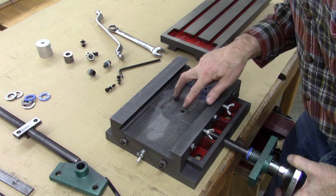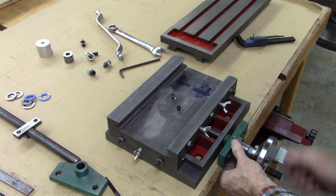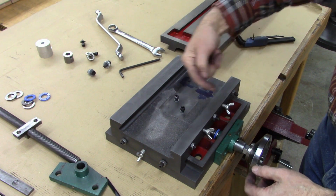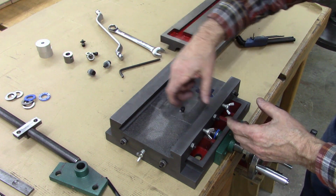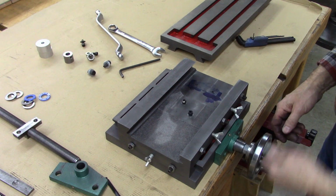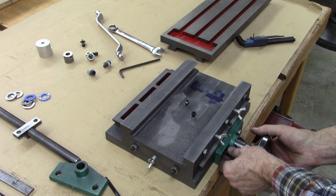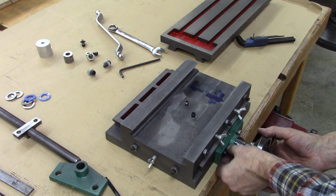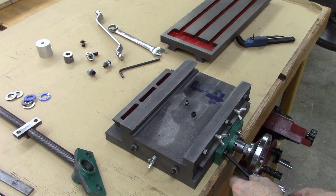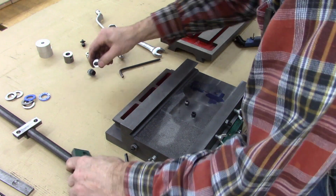And you can line the holes up right here. The reason I said that clearance area needed to be toward you was because when this nut gets close to the handle, if there's any misalignment, it gets really critical and it'll try to bind up. Matter of fact, if you have problems lining this up right here, you can oversize the holes in these brackets. That's what I did on this one. This one here I didn't have to. You can oversize them and put washers under them, do it like that.